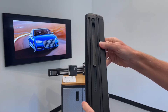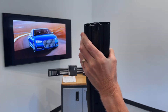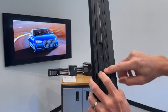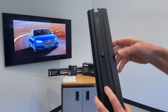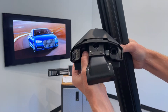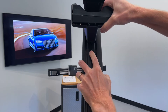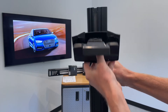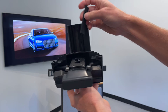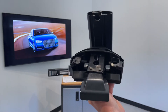When it's time to install the foot onto the bar, there's an underside slot. Opening up this end cap, you'll see a measuring device with scale numbers that correspond to numbers assigned to the foot for its position on the installation. You press on that silver tab, slide the foot onto the bar, and bring it to the mark on the measurement device. The area where the track is still exposed can be filled in with rubber that's supplied — just cut it to fit — then return the end cap into place.